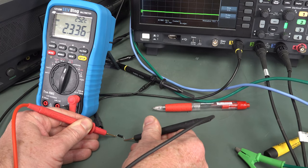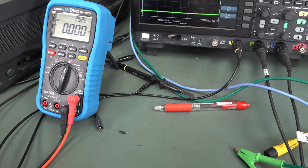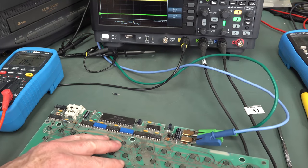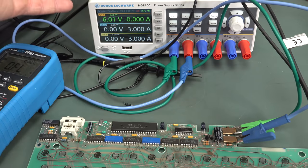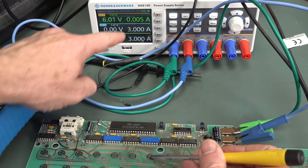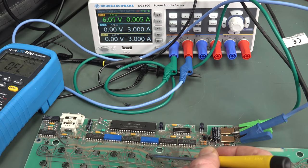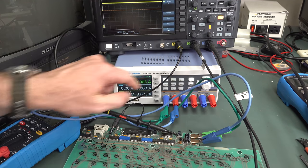No wonder the output's going to be doing silly things. The output's high, which is forcing our reset. Pin 2 is also high — it should be low. There you go, something's wrong there. That's supposed to be a 2.2 microfarad tantalum cap — one of those axial tantalums. But it measures okay. Hold on — I've left that capacitor out and repowered it up to have a play around. It's drawing no current. But if I short out a key — bingo! It draws microamps, probably until you press a key. I think she's working now.